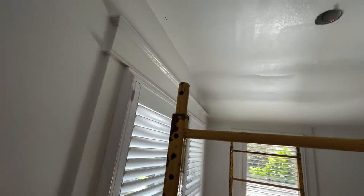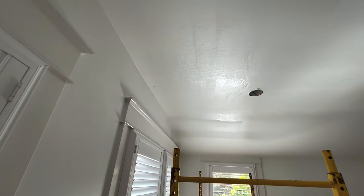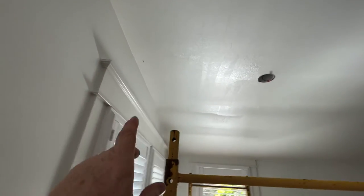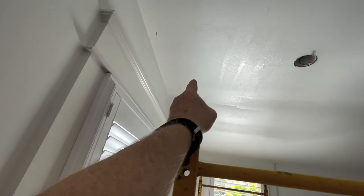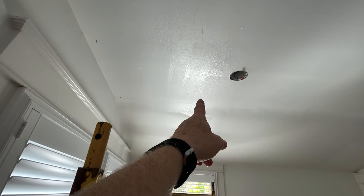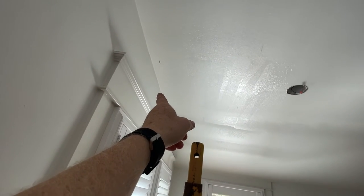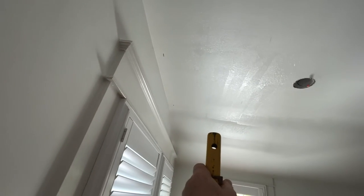And so in order not to be off with the wall covering, I give myself a 2-inch play. That's generally considered appropriate. You're giving yourself 2 inches. In other words, from this point all the way over to here is 25 inches, and then I'll have 2 inches overlap, which I'll trim off. Okay, so let's get to it.